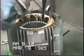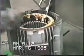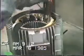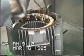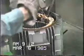You will now see the last portion of our stripping process. Using a hydraulic lift located on top of the machine, we use what we refer to as tongs. These tongs are used to clamp onto the windings and tighten as the hydraulic lift pulls them out safely and quickly. The hydraulic lift is operated by a foot switch, which gives the operator free use of his hands.